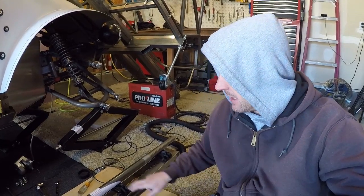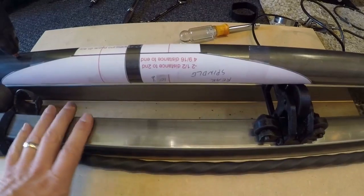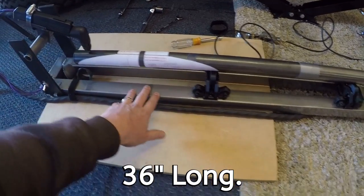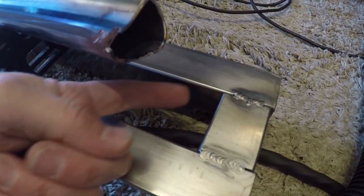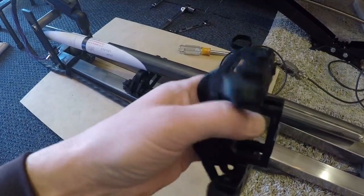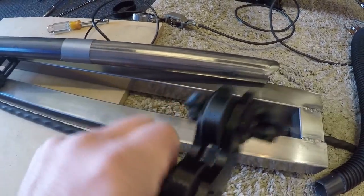If you're interested in making one of these yourself, I have the STL files for the roller devices in my shared folder — I'll put a link in the description. If you have a 3D printer, or know someone who does, or use an online printing service, they'll make these little roller devices. As for the frame itself, mine is 36 inches long — I'd make it longer if I had more space. The rollers are two inches wide, so you need to give yourself a two-inch gap between your rails so the rollers can slide back and forth freely.